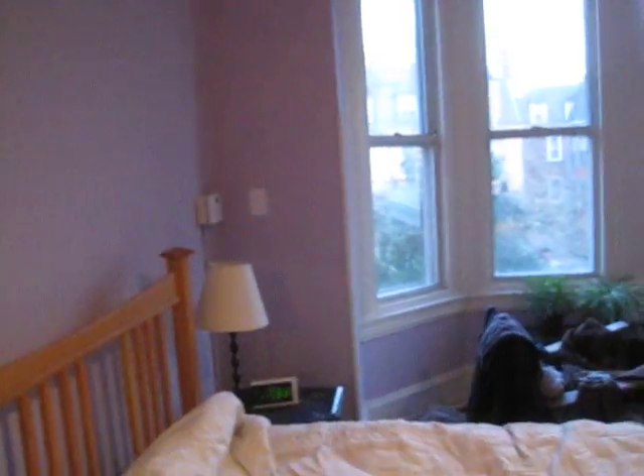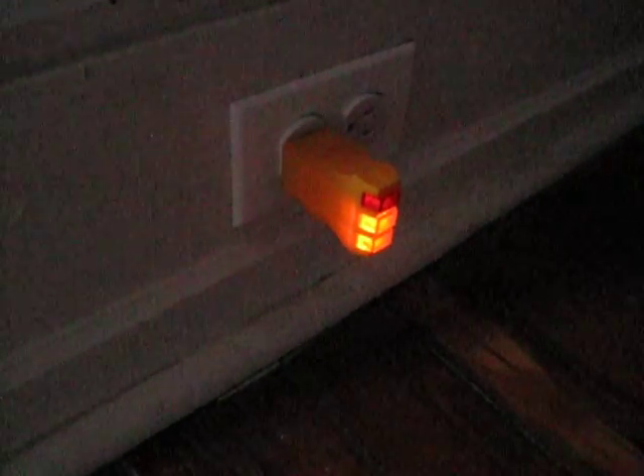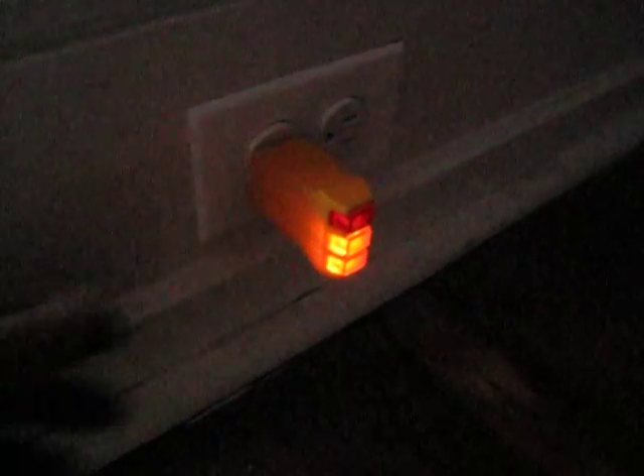One interesting feature here in the master bedroom is a kill switch for the photo-control porch lights outside. I still have to install the photo control on that fixture. I'm collecting my receptacle tester here — it's indicating two lights for ground and neutral and correct polarity.